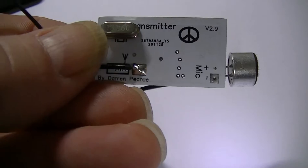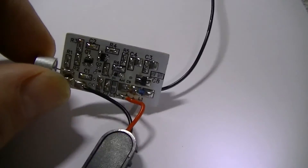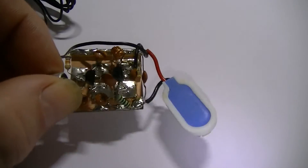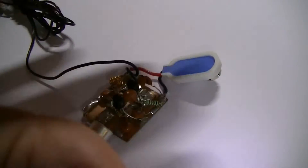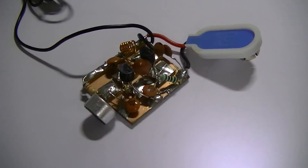They are great transmitters — over a mile range, well over. A lot of people doubt that but I've done extensive testing on these and got about 1.2 miles. These simple tank circuit ones are just fun, but I don't recommend you use these — they're very unstable. Very easy to build, but you've just got to go near them with your hand and they'll drift off frequency.